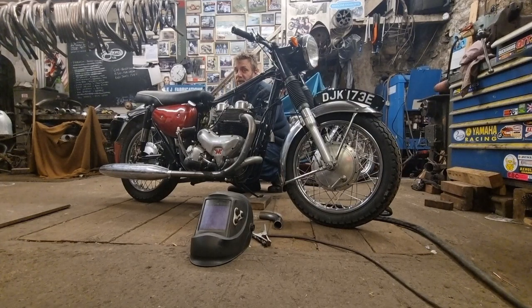You can hear me on video there because I've not clipped and speeded it up yet. Before you start welding on that bike, you need to make sure the battery's disconnected. It's got a little gel battery in it. Can't get it out of the toolbox because it's rammed in there — I don't know how he's put it in. The Allen keys to get it off are absolutely tiny. I just noticed it's got an inline fuse, and the customer has already taken the fuse out, so that battery's not connected to the bike.